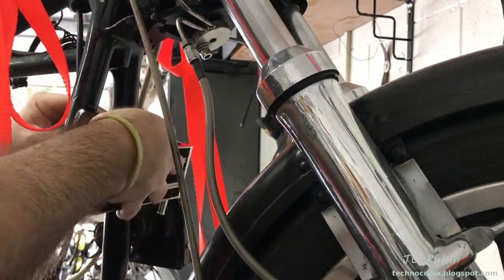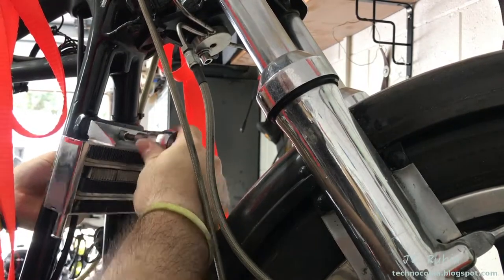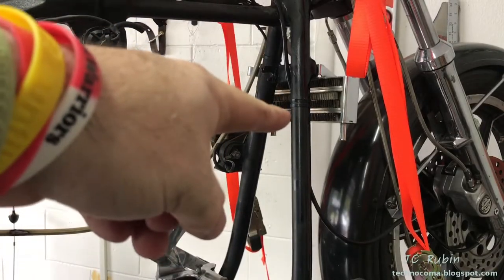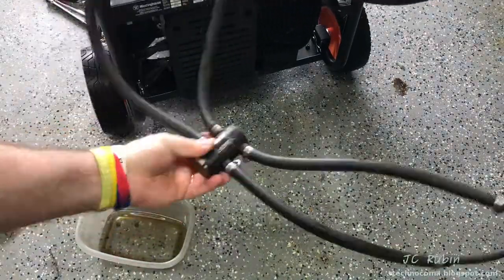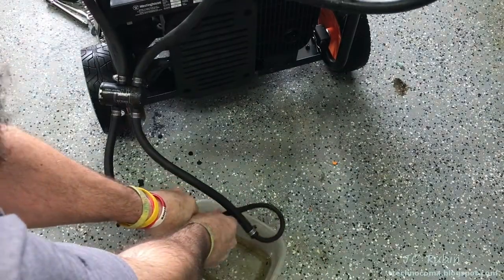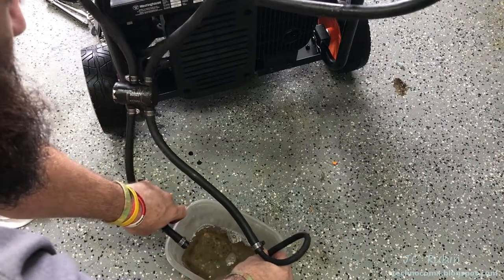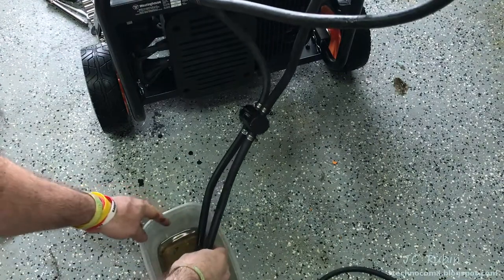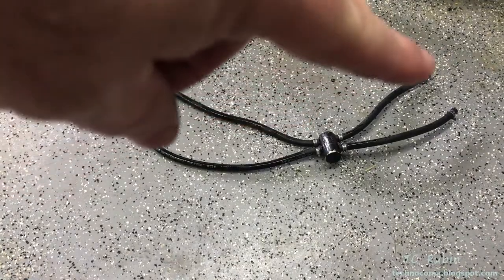We carefully reinstall the oil cooler back onto the frame. With the cooler portion done we now address the thermostat portion, which has also been filled with kerosene and sloshed around at regular intervals to loosen up any dirt, sludge, or materials inside. It's opened up, set to drain for a good while, and everything is ultimately washed out. I'll be taking it apart in pieces, blowing it out, and reassembling it in order so I don't lose the position of the hoses.